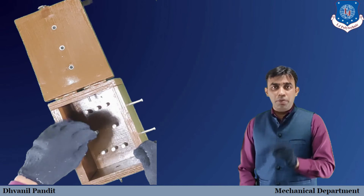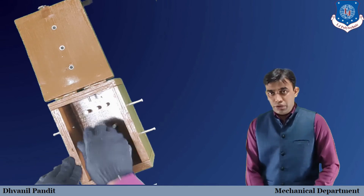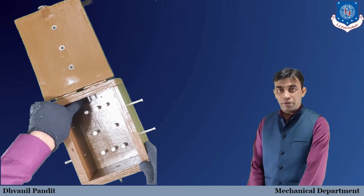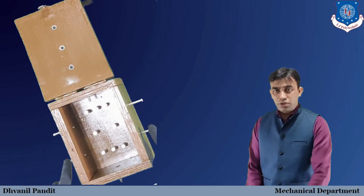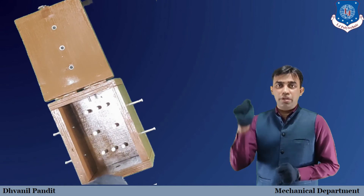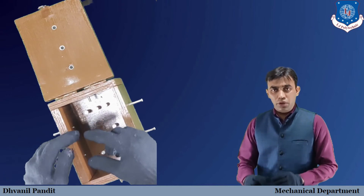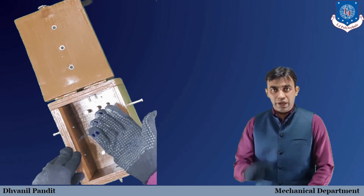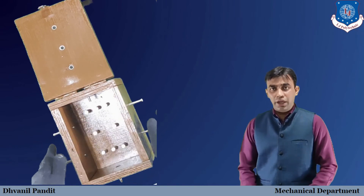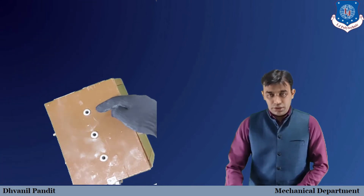The locators work as support pins, and in this particular design they also work as fool-proofing pins, so semi-skilled or unskilled labor can easily use this jig. Locators restrict the movements of the workpiece. We have also provided clamping screws — visible on the inner side of the box — to resist and restrict movements due to cutting force and vibrations, including movement along the loading/unloading axis.